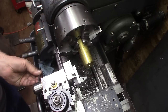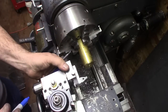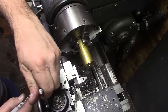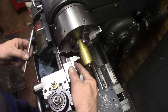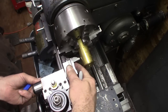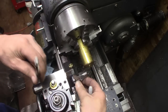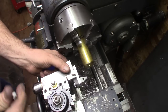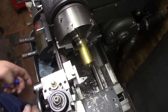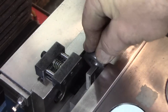Then I'll pin it to the shaft — down low. If I mark the horizontal position now and I want it here, then rotating 180 degrees the other way it would be about this position — that would work. All the way down to all the way up here would be just fine, and I would clear the lock on the handle even if the handle was a little farther over. I have a parallel on the bottom to raise it up a little bit, and I have a 15-degree angle block in there with the boss set on top — so we've got 15 degrees.